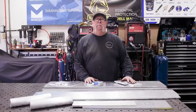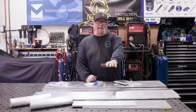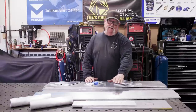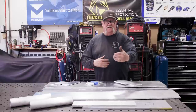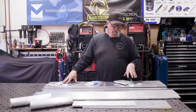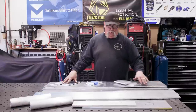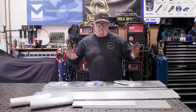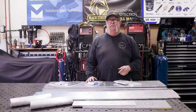So we've got all the miscellaneous aluminum here. Up here we've got some 3/8-inch thick plate and some round tube for brackets. We've got some small quarter-inch or 3/16 plate for small boxes and brackets. There's 3/8 by 4-inch aluminum plate for the top and bottom of the I-beam, and 12-inch by 4-foot long plate for the inner web. We'll be doing miscellaneous TIG on smaller boxes and aluminum MIG on the bigger pieces. For machining, we'll use a 7/16 rounding bit. Let's get started.